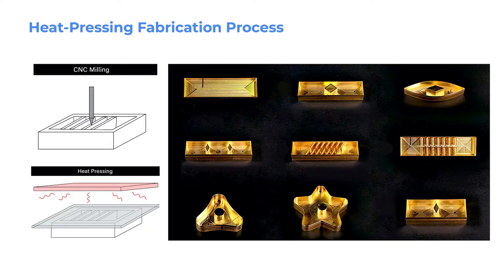The modules of NewBots were developed by a heat pressing fabrication process where two layers of PVC film were sandwiched together and then sealed along specific origami-inspired patterns. The CNC milling and heat pressing fabrication method achieves an accurate and smooth geometric pattern without wrinkles. The bronze molds allow consistent patterns useful for mass production.